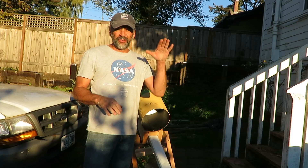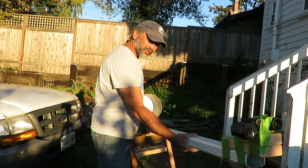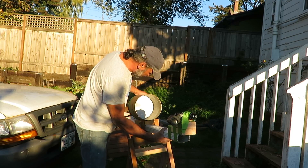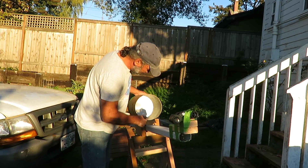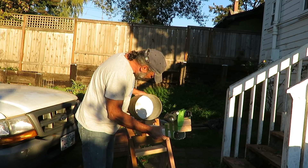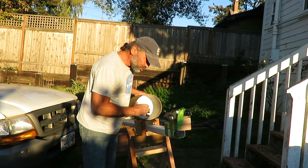I had to wait for the sun to get a bit lower, which made it easier to find the sun in the tube. Basically, you slide the tube in — it's actually easier with two people, with somebody holding the other end. You want to get it close enough so you can see where the sun is projecting on it, and that's how you adjust your binoculars. Get as close as you can, because if you have it centered close, then as you expand it out it should stay centered.